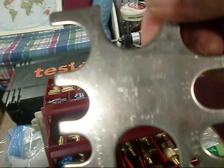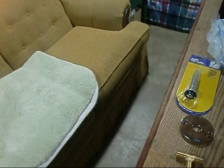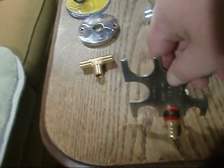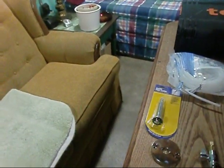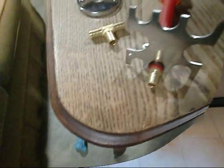They also gave me a go and no-go device here, so you can slide it over your pipe to see if it was actually crimped correctly. So let's see. This is the no-go side, so it's not fitting over the no-go side. See? Get down here on it. Sorry about the shakiness. Let's see if she'll fit over the go side. Yeah, good to go.